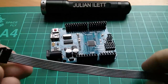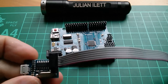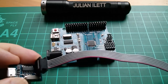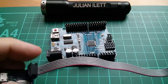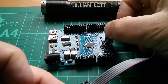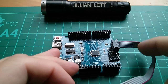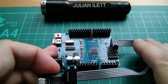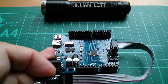The way I tracked down that it was actually the crystal that was the problem is because I was having no luck communicating with this thing via USB, so I thought I'd use one of these - it's a USB tiny ISP. It has the six pin ISP header. You connect the six pin header plug to that six pin header there, and then you're programming the chip directly from these six wires. All of this other stuff is not involved in this technique. The only other thing being used in this configuration was that crystal, and that's why I decided to remove it.